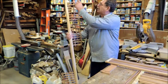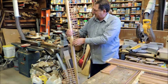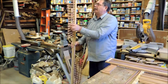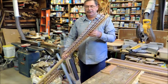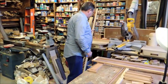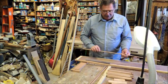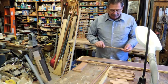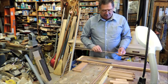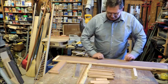Next we'll be sanding these to tie in once they go vertical. There's one on the front and two on the back, so we'll just sand them up before we start cleaning the other one up and putting it together. Here again we sand the edges, take the edges off, so that when you go to paint it, it holds the paint — otherwise it doesn't hold the paint very well.